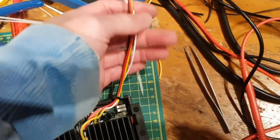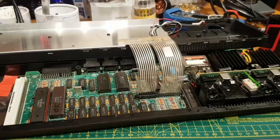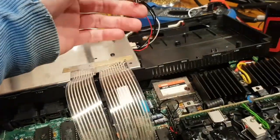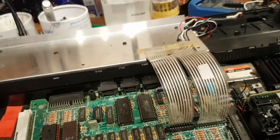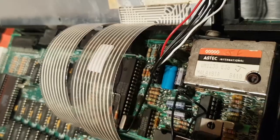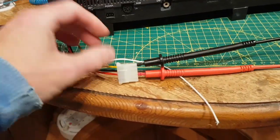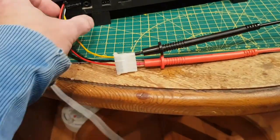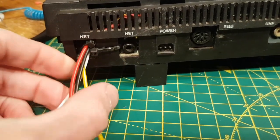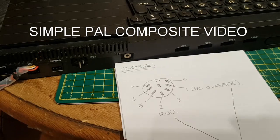I haven't got anything for minus 12 but I'll leave that for now. Shiny new ribbon connectors. I'm just going to check the LEDs and make sure I get them the right way around because the LED power light wasn't working for some reason. Red, black, white, black, grey, black from top to bottom. Good idea to quickly check there are no shorts on the power rails - and it doesn't look like I have.